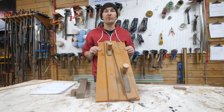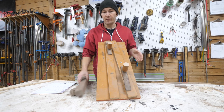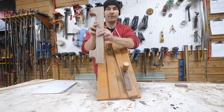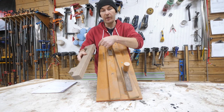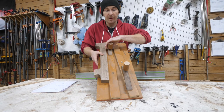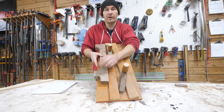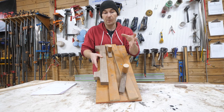This is a jig that we're going to use at the table saw. The side of it's going to ride on the fence. We're going to take the front leg blank, and right on it we have some lines that we're going to align the top and bottom to. We'll be able to clamp it down with these little doodads, and it's going to cut this joint location perfectly, just where we want it.